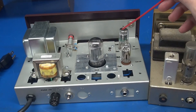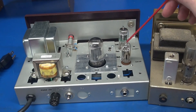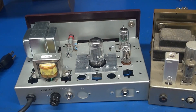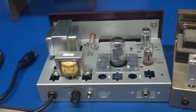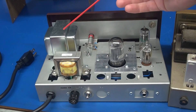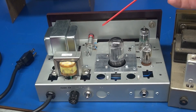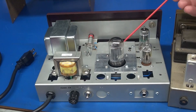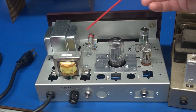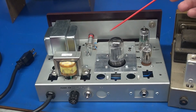The 12AX7 preamp input just makes it, and here is the little 6AV6 tremolo tube. I still use the PT31 output transformer. The power transformer is actually a custom-made unit done years ago for the shop — about a 450-volt center-tap transformer. I'll cut to the schematic so you can review that. You'll see it's almost identical to the Lafayette except for the higher voltage of this transformer and a different biasing resistor on the 6K6.